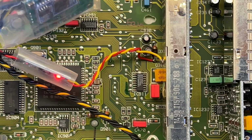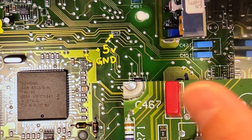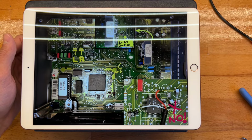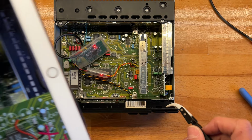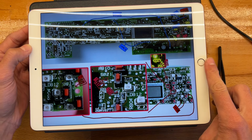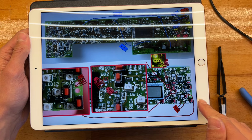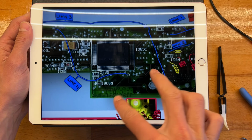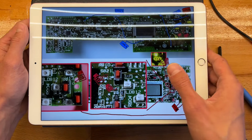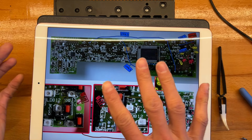And as for the buttons, that is where all the magic happens. So this would take, let's normalize it to 5 hours, 1 to 5 hours, depending on how slow and fiddly you are. The buttons are 3 times as expensive time-wise. So the Becker BE2210, the one with the 2 buttons, the Becker 1150, I think, and also this one use a multi-layer board for the front panel. So it's more than 2 layers. I think it's 3, maybe 4, I don't know. I have to check. But for this to work, right, you have to disconnect the 3 buttons from the matrix.